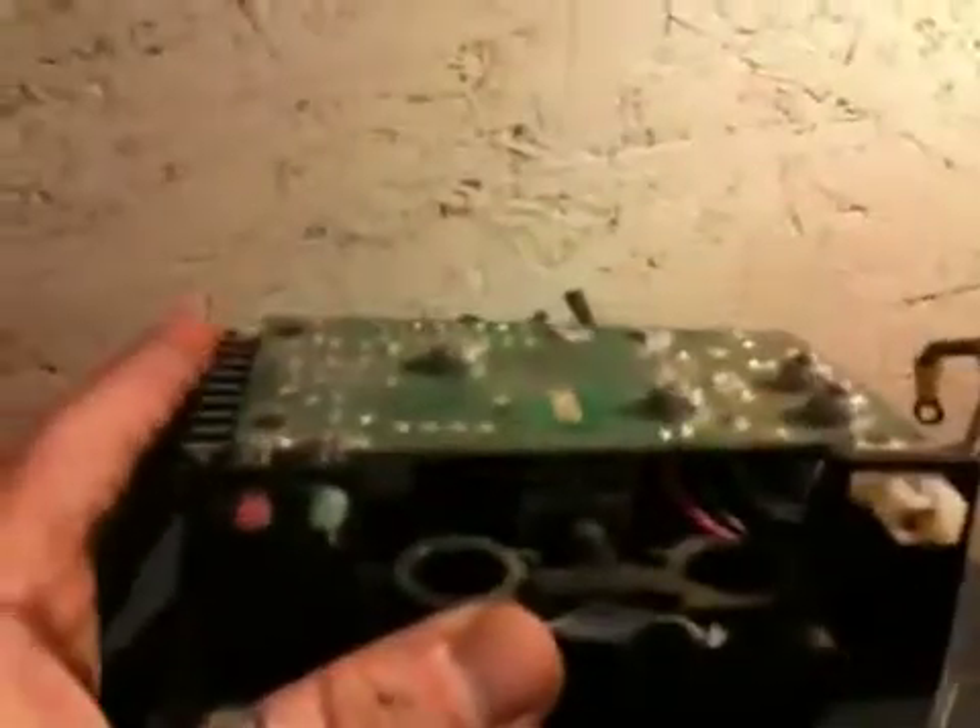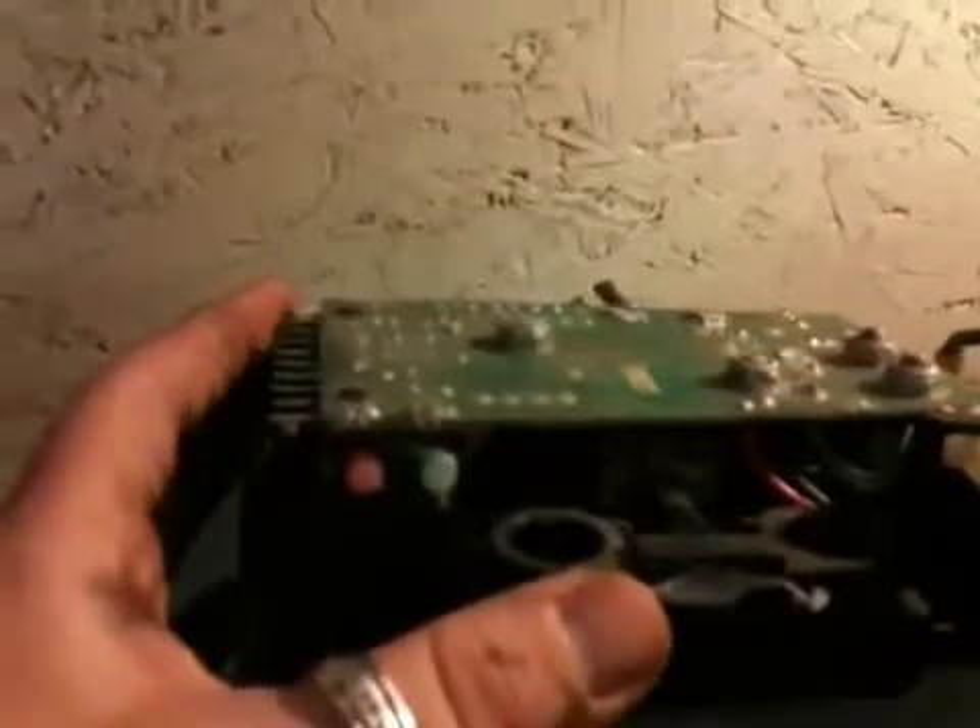There's the other charge controller. I'm sure it works fine — I checked it with a volt meter and it kept the battery up — but both lights would come on and stay on, which to me didn't seem quite right. So I just swapped it out, and the little plug was busted so it wasn't holding the charging cable.